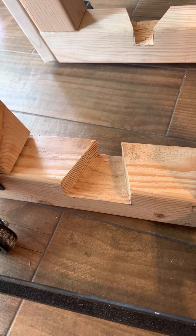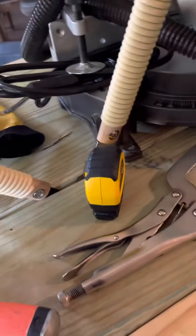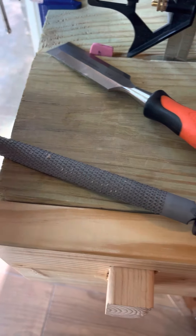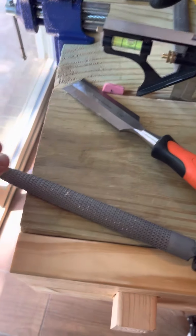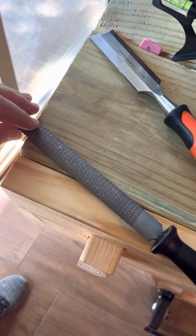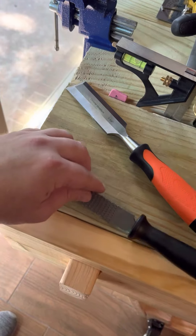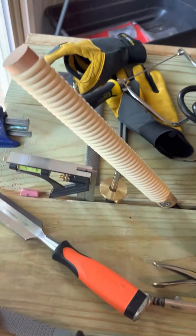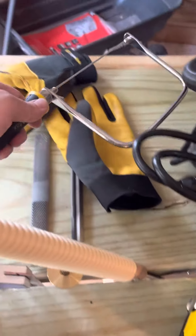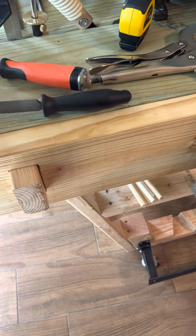After that it's just knocking out chunks of wood. This one has been filed down already. I'm showing you how I make all those cuts, and then you just go at it hard with one of these wood files in the middle — to flatten it out. It's got a flat side, and this round side I use for when there are little valleys on the bottom, because your saws can only do so much. My coping saw is just not firm enough to go at an angle — you can rotate it and cut sideways but it's just not strong enough in my opinion, so I like to file down the valleys.